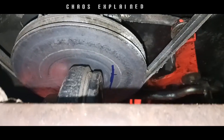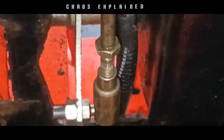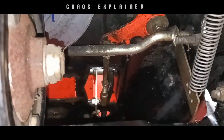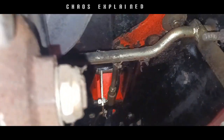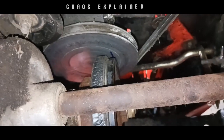I made a mark to show me if I'm gaining or losing, because it was getting too confusing. I've got this guy backed all the way out about four threads, and I was going the wrong way. I need it to engage in the opposite direction, so I need to sink that guy all the way into the thread. There is my blue starting line, and by simply adjusting that nut — probably over the years the wear of all this linkage got a little slop in it — that solved my issue. I was going the wrong way initially, and now it's engaging, so I'll have reverse on this unit.